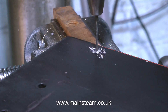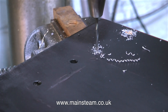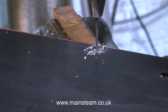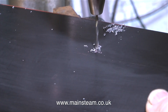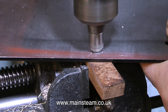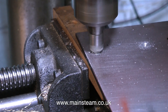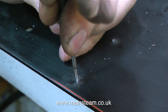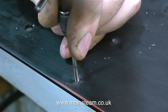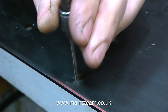Over now to the drilling machine, and I'm drilling some holes in the bed plate using a number 48 drill, which is a very good tapping size for 6BA. When I showed this operation with the boiler's bed plate, I drilled the holes, threaded them, and then countersunk the underneath. But this time I'm countersinking the underneath before threading them. It makes very little difference either way, because the countersink is a bit blunt and it raised a burr in the bottom of each hole, which had to be drilled out before I could thread the hole. And in this clip, I'm doing just that.